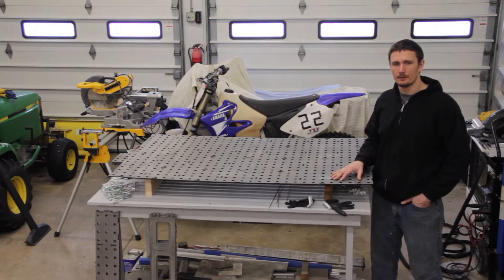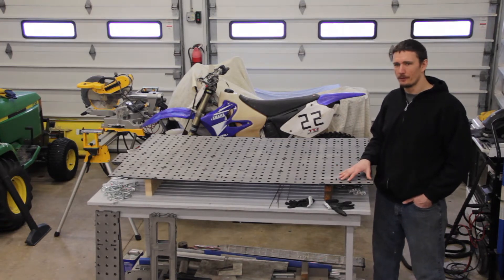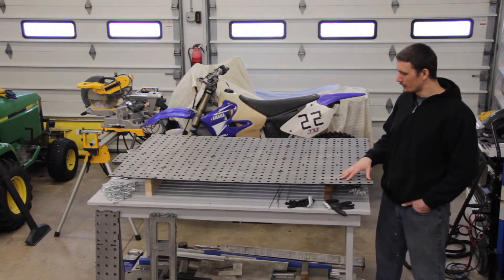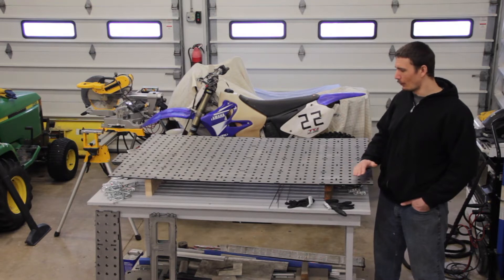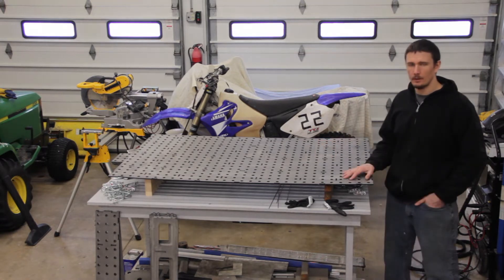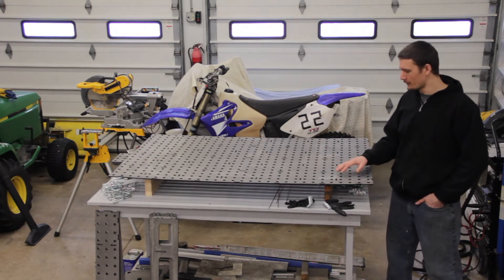Now that we've finished cleaning all the parts, we're going to begin installing the support ribs. The first thing we're going to do is look at the tabletop itself and determine if it has a crown or bow to it. WeldTables suggests that any crown or bow present be positioned down and away from the support ribs in the center of the table so that it's easiest to draw the crown or bow back into position against the straight ribs. In this particular table, you can see it's already positioned with the crown bowing down. The ribs will go on the top, then we'll clamp it in place and draw it all back together. All the short ribs are going to get installed first — I'm simply going to fit them into their respective tabs.